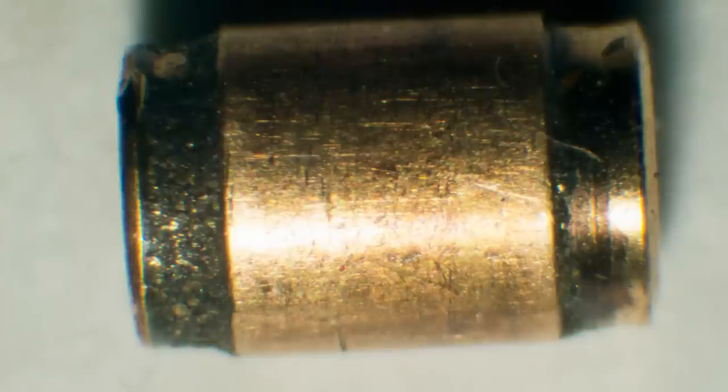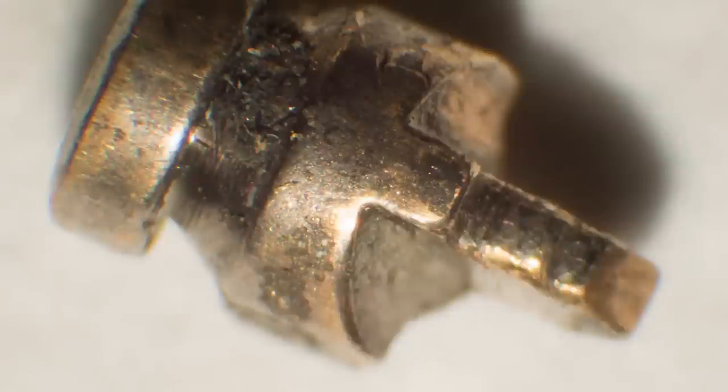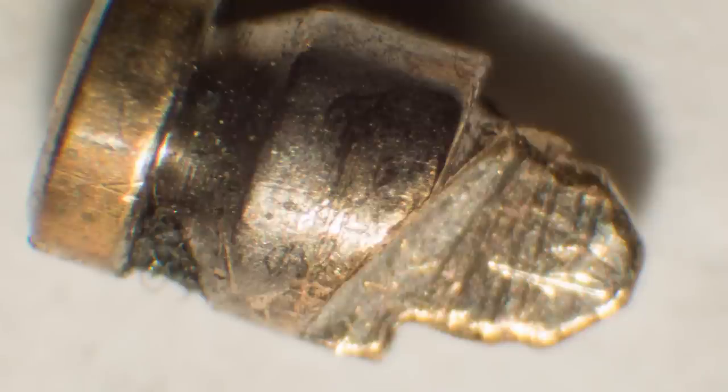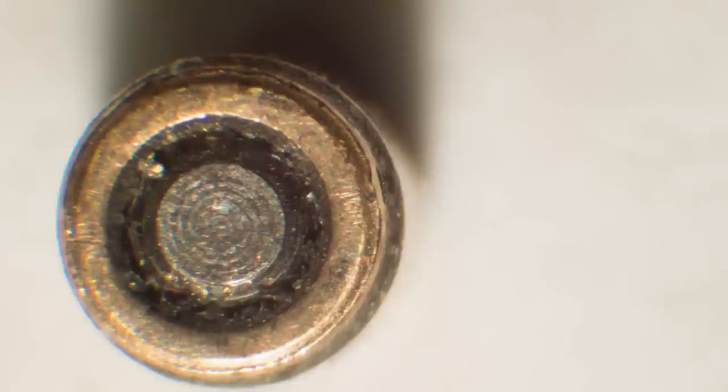And then of course we have our barrel shaped pins, with a little bit of material taken off the top and the bottom of those to further obfuscate picking. And here we have our key pin. The key pin is neat because it's so narrow — you remember that it's riding on a very thin part of the key. You can actually quite clearly see the scratch marks from where people have attempted to pick it. And of course it also has that big chunk taken out right before the top of the pin, so that if you over-lift it, it'll get caught up and become incredibly difficult to make any additional progress with. Really beautiful pins. Just going to take a quick peek inside one of our driver pins — this is that barrel pin — and this is a steel insert to make drilling more difficult, making it much harder to drill your way through the shear line of this lock.